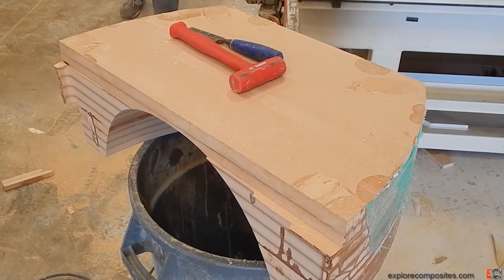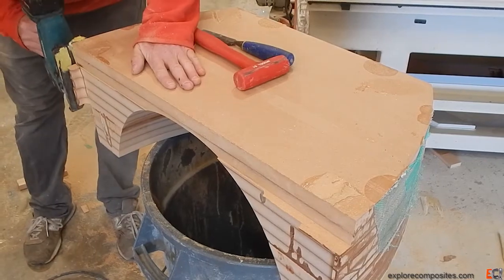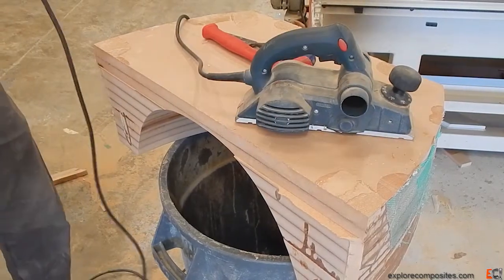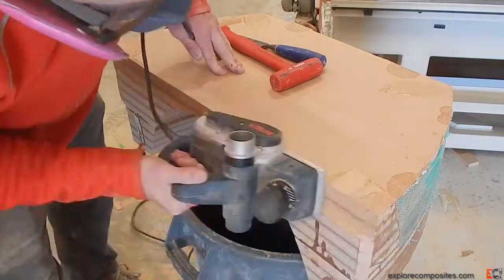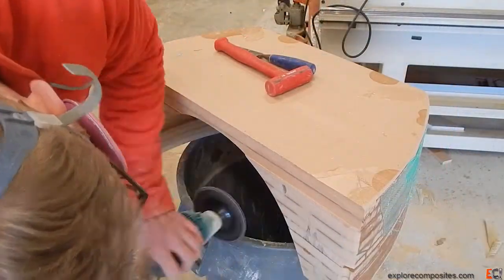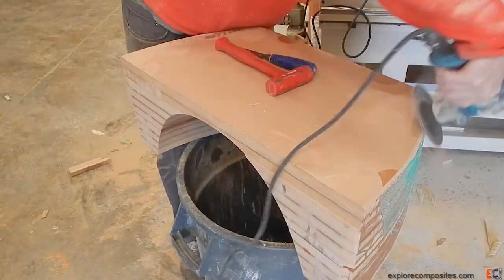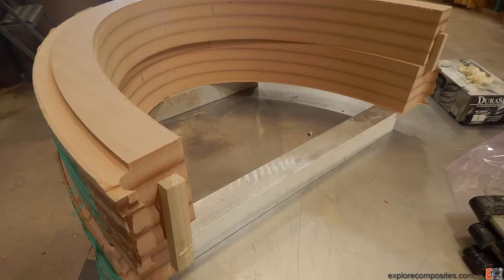A lot of this is pretty quick and dirty — I'm in a huge rush and cutting all the corners, working near a lot of trash cans. I'm just giving it a rough plane, making sure not to mess up the machined surface, so I'm just taking off a bit to not ruin my alignment feature, and smoothing up the bottom so it's not sharp and won't cut me when I'm handling it.